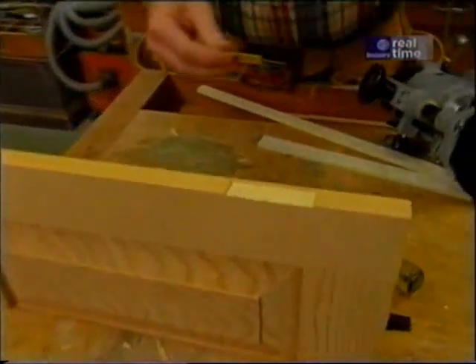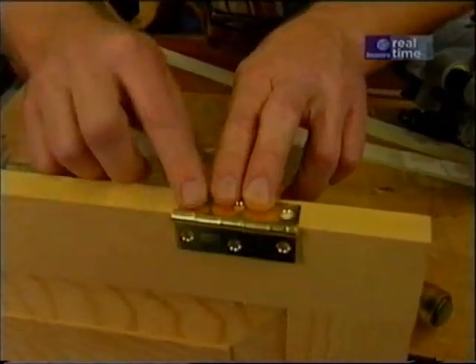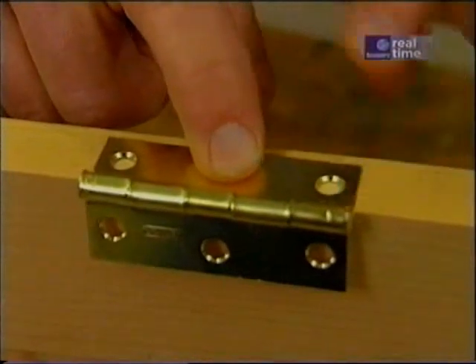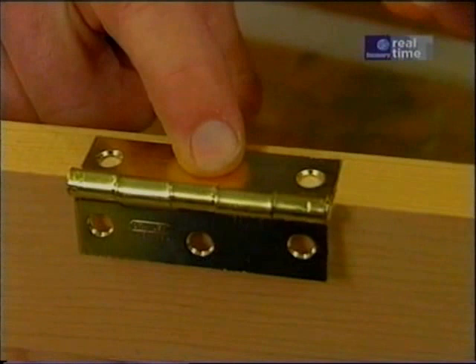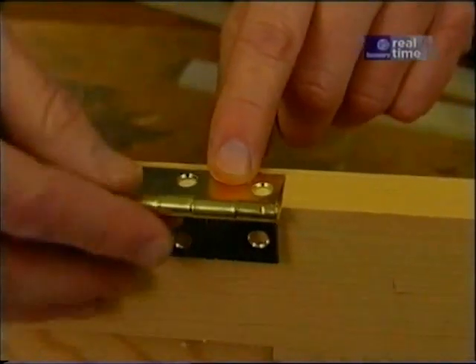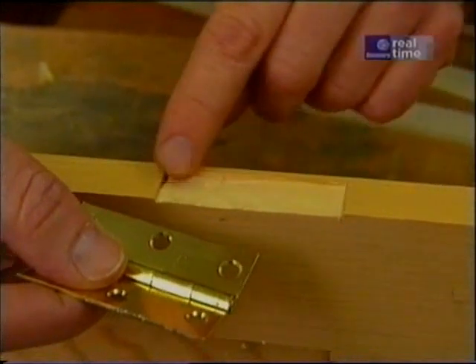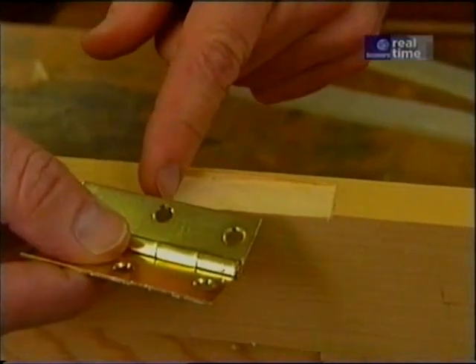Over here I have a door clamped in the side vise, and I want to tell you why we mortise for the hinge. The hinge mortise makes the hinge flush with the edge of the door — that's the correct procedure. What that does is close the gap between the door and the face frame. But more importantly, this little pocket provides an edge, so the door hangs on these very shallow shoulders rather than just on the screws themselves.